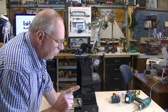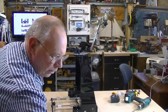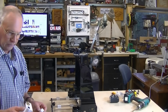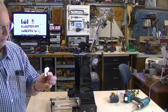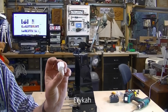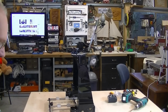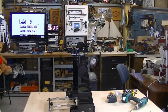Having said that about parts, there was one part here, if I can find it. There's a couple of 3D printed parts here. Now this is the main bearing block, I suppose you'd call it, that holds the x-axis. They're okay, fine, not a problem in the world. However, the little fan nozzle, I just hope that that is not a sample of this 3D printer's job. I would say that's been printed without being cooled. It's a bit misshapen and a bit ragged on the inside, so we'll put that down as a mistake.